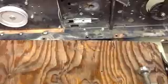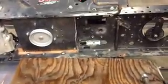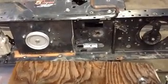But the rest of it sits at 6 inches, and when it sits absolutely level, it is actually 6 in the back and 6 1/4 in the front, which is what I'm trying to achieve. I want the front to be not much, but a little bit higher, so that the oil will always run down to the back of the motor. So I think that's about it.